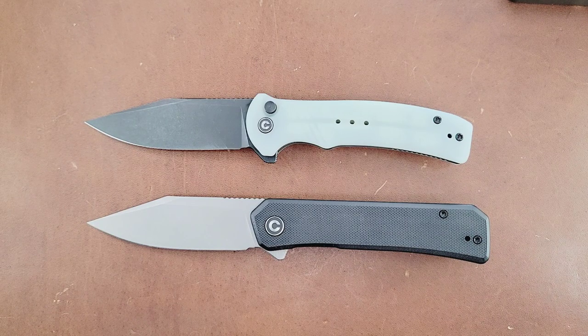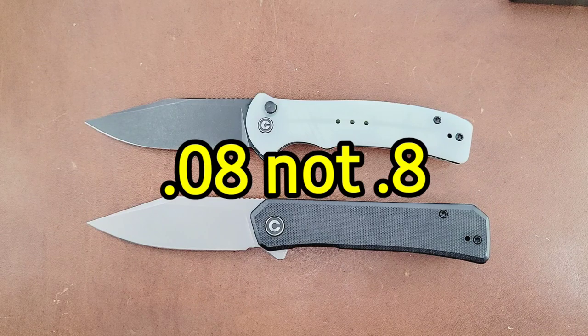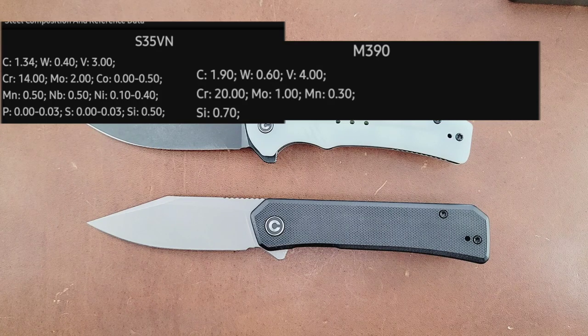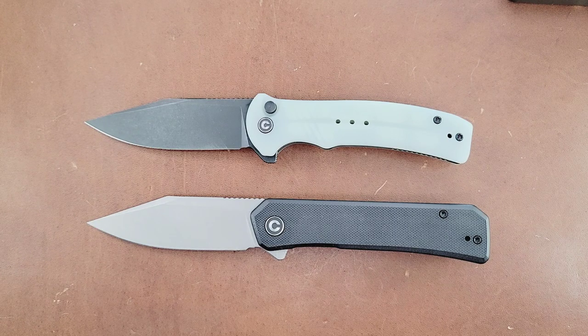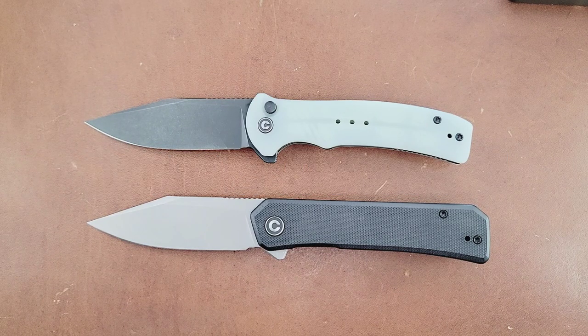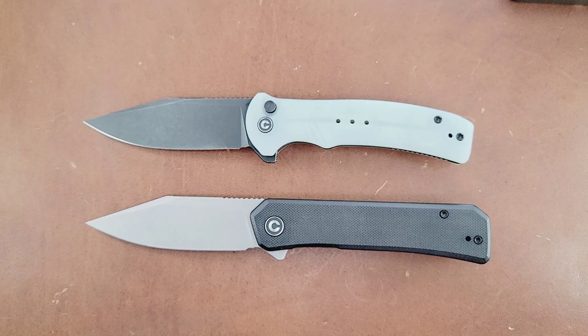The next difference is the blade steels: Nitro-V versus 14C28N. There's not much of a difference — it's virtually the same thing, just added vanadium at 0.8% extra. If you look at S35VN or M390, those have 3 and 4% vanadium content along with molybdenum and everything else, which adds a drastically different edge wear situation. So 0.8% isn't going to make much difference. In fact, Nitro-V actually sacrifices 1% chromium to get that extra 0.8% vanadium, which in my opinion makes it a little less corrosion resistant while not really adding enough edge retention. So 14C, despite being the generation before Nitro-V, is still a little bit better in that regard.